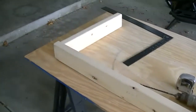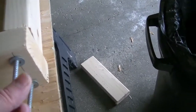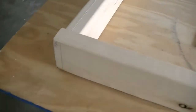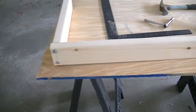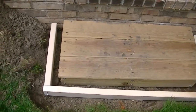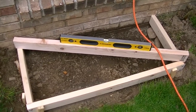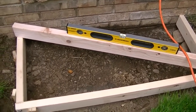This is what the frame will look like — it's a three-sided frame because the back goes against the wall. I got the lag screws all there and it'll screw into this board on each end. Once I get that screwed together, I'll square it up and level it. Frame is completed — now I'll go set it in there, level it up, and be ready. You could call that an apron — I've got a couple inches all the way around the perimeter.